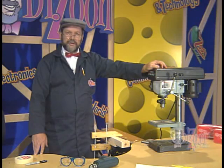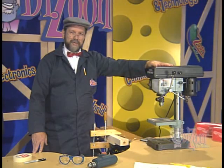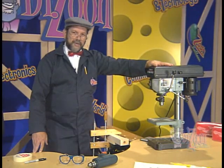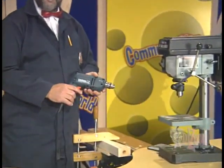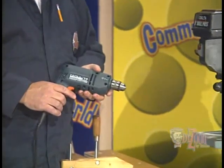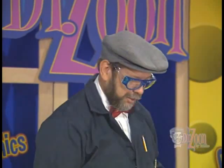There are two different ways we can drill the axle holes. The preferred method is with a drill press, as it assures a perpendicular hole in your dragster. The other method, if you don't have a drill press, is to use a hand drill — that's what I'm going to show you first. Before we begin, we need safety glasses. Also, anytime we have long sleeves on, we need to roll them up before using any power tools.